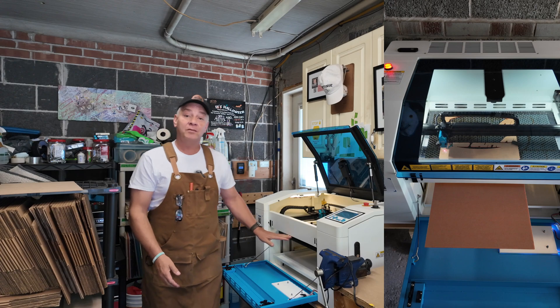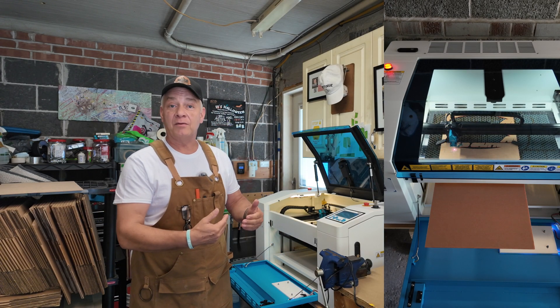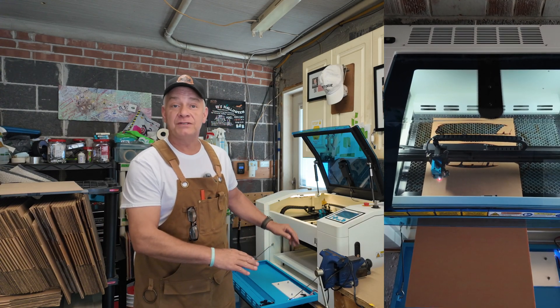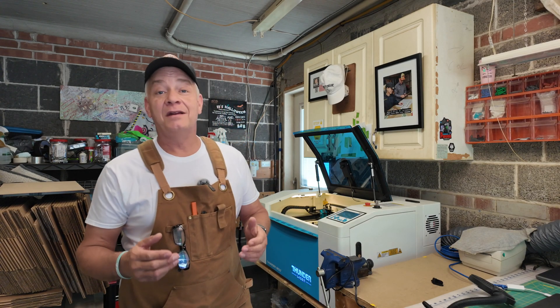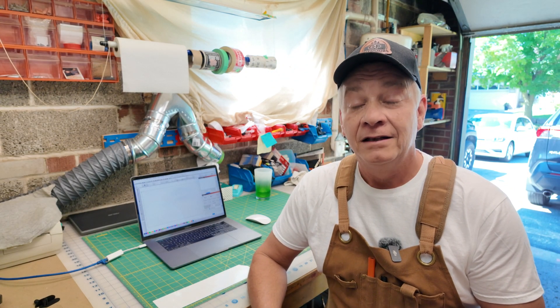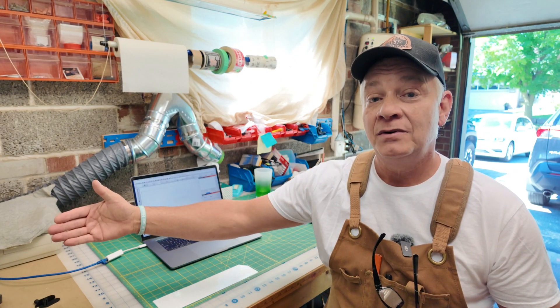Up until just recently, I've primarily been using this feature to cut down larger pieces of acrylic or plywood when getting those standard 12 by 24 inch sheets — sticking them in the front and cutting off that extra 4 inches so I can get a full 12 by 20 sheet in. But recently I found another great useful purpose for it. I'll have you follow me into Lightburn, and I'm going to show you a feature called Print and Cut. You may have seen it on other videos, usually using a unit with a full pass-through, but I'm going to show you how to use it with the Bolt with only a front door.